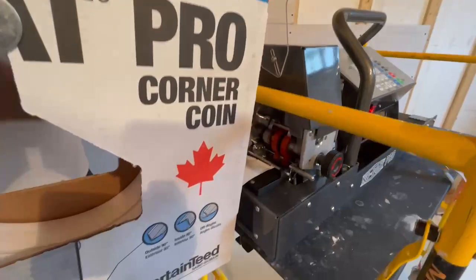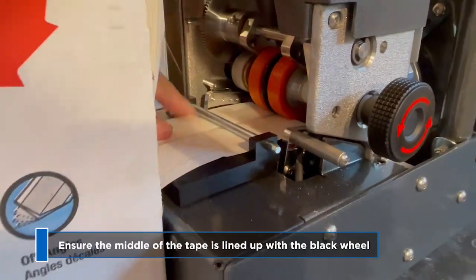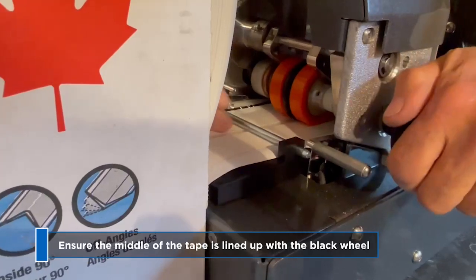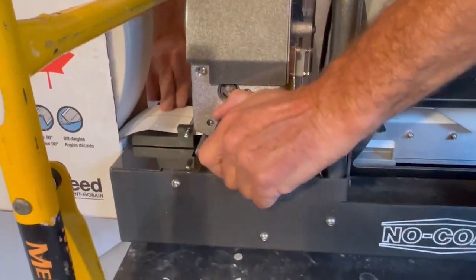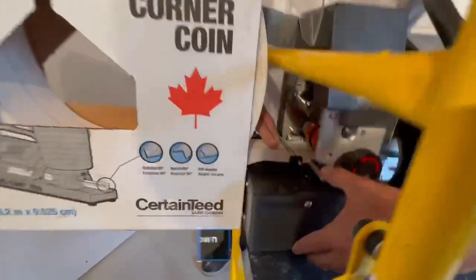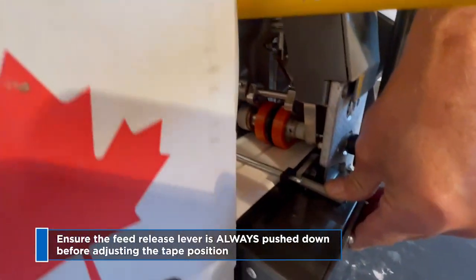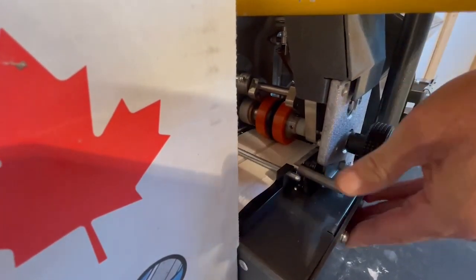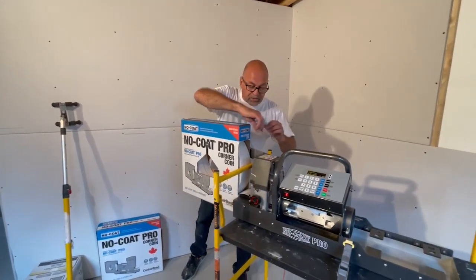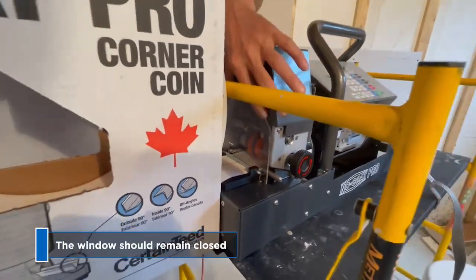You have your arm spindle open like this, with the spindle axis here. You put the box on the spindle with the axis outside. Pass your tape under and place it in the middle. You have the feed knob — it will move only one way — so you turn it until it touches the blade, and you're ready to go. If you need to pull back the tape or move it both ways, remember you have to press the release knob, so you can move it back.